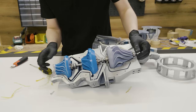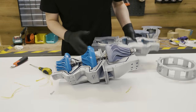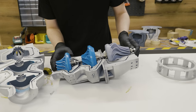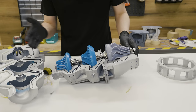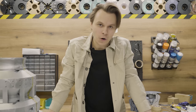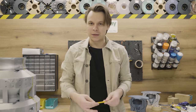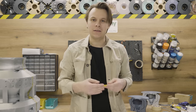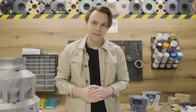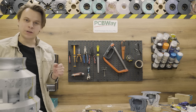Well, to be honest it's not that bad. I can see most of the wear around the first impeller. The second impeller and the turbine are completely fine, but the first one has worn a bit. The other stages are way better — it's probably a little misalignment. Overall, this project was a success for sure. This two-stage centrifugal compressor worked, and worked really well. Even though it's worn a bit inside, I did explode some balloons, which has been my ultimate goal for three months. So I am satisfied, and I can peacefully stop 3D printing compressors. The next video will be about something else. Big thanks for watching, and all the files for this project are in the video description. Hit subscribe and like if you enjoyed the video, and see you guys next time. Bye!